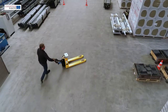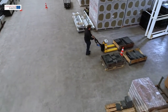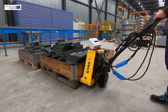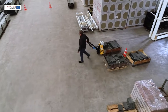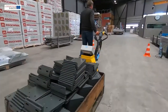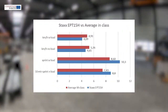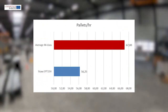The pallet truck has a capacity of 1.5 ton. However, the overload valve may not be correctly adjusted, because we cannot lift more than 1,350 kg with this test truck. While driving with our different test weights, the Stax performs neatly, but not excessively fast. The measured speeds are in accordance with the manufacturer's specifications, meaning the truck scores below average in this class, but it does leave a positive impression.